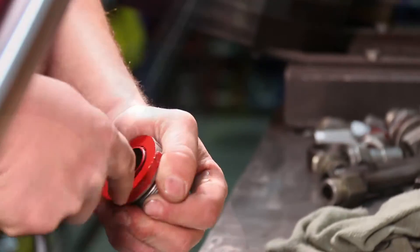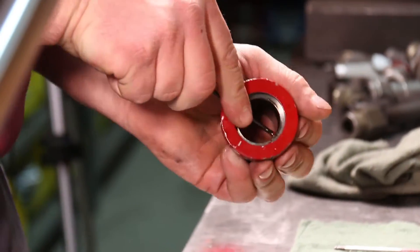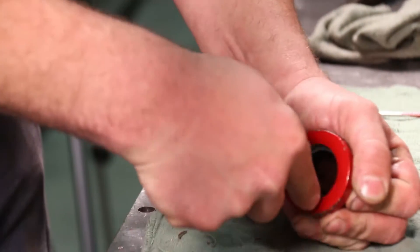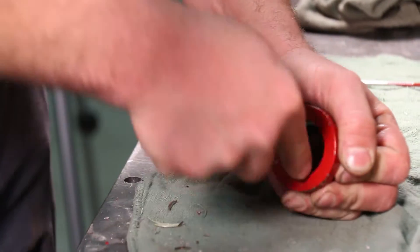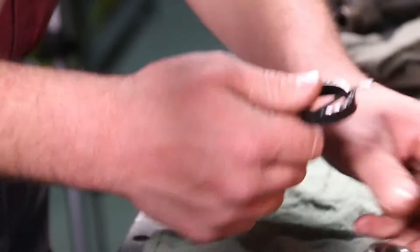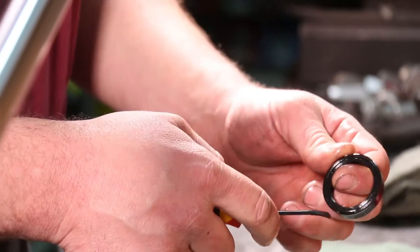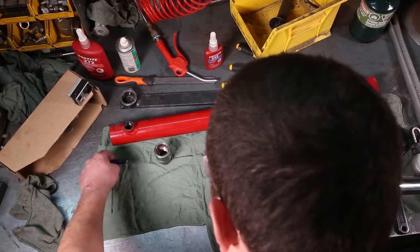The inside ones are a little tricky. That one just peels out, and there's one inside as well. This one is the hardest one to change — just the nature of it. In any seal cylinder, the smaller the cylinder, the harder it is to change that seal. It's a two-piece seal, so there's an o-ring inside the seal — we'll get to that later when we're rebuilding.